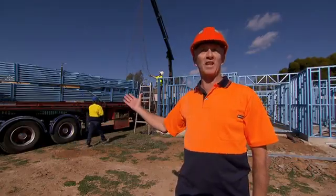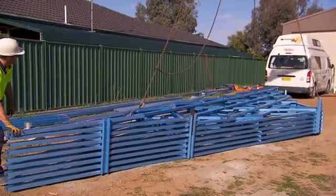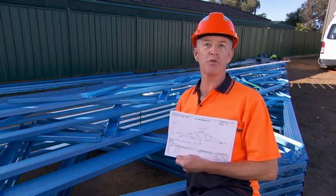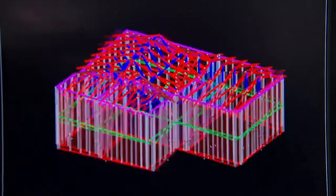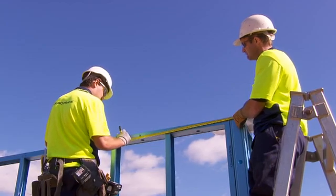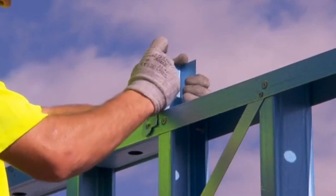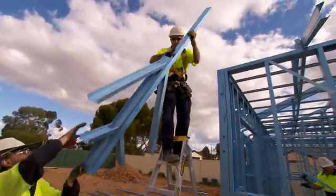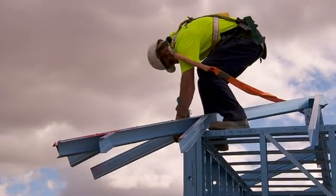Now we'll look at roof frame installation. Stack the trusses in the order they will be required for installation. EnduroCAD software has produced drawings to help us install the roof frame. Your frame may come with factory installed truss hold down brackets. If these are not installed, then using the truss layout drawing, mark the top of the wall to indicate the truss locations. Install the truss hold down brackets to the top plate of the wall at each truss location using the connection system specified in the construction manual. It is generally best practice to install girder trusses and the hip ends before proceeding with the installation of standard truss runs.